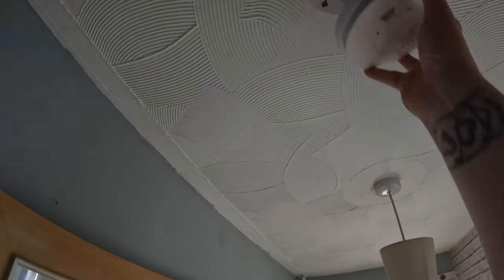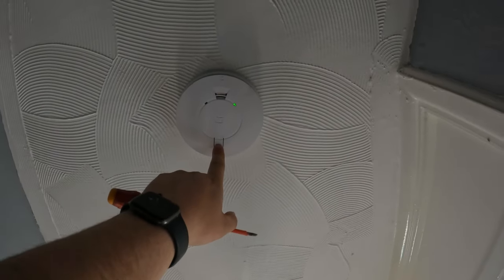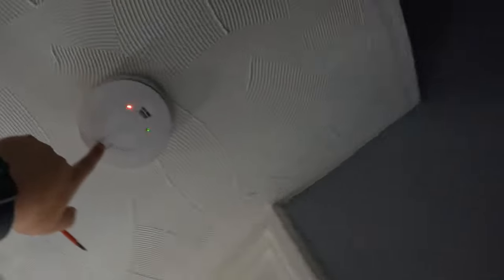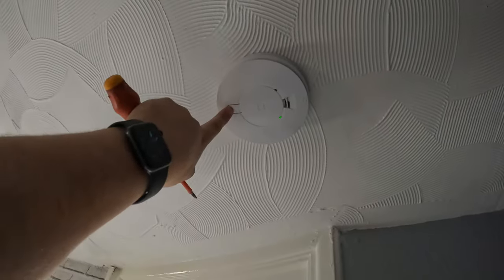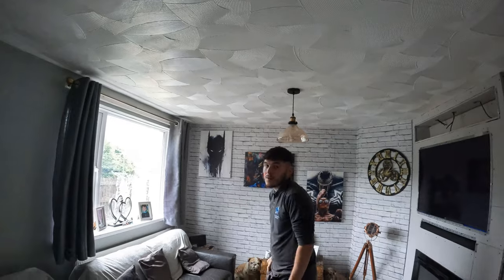These are the Aico fittings — we always use Aico for smoke alarms. There's not much better out there; such a variety of range. The head just slots onto the base like so and there we go, ready to test. You just press this button and hold — and then you can hear the upstairs one going as well. When you release, the upstairs one still carries on for a moment. That proves the interconnection is working exactly as it should. Good job Layton.